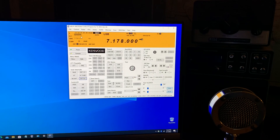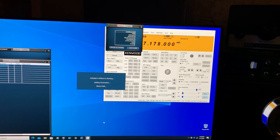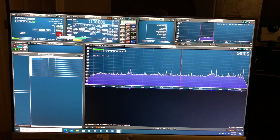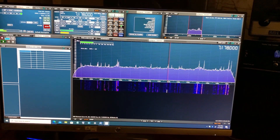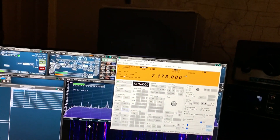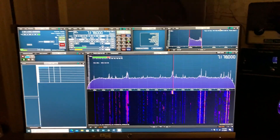So I just got a small 3dB pad which didn't affect the receiver or the pan adapter display in any way. Let me see now if I can keep this thing going and load the SDR Uno program. I don't think there's going to be a conflict in the port. It takes a while for the whole thing to load and all the windows to pop up, then you go up here and hit play. So you can run both the SG Kenwood control program and this. You just leave the control program in the background, and if you ever want to change to it, I think you just do this — and you can actually do more. Both of them work.